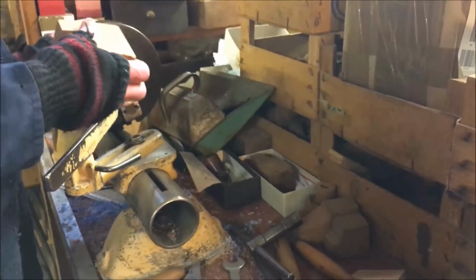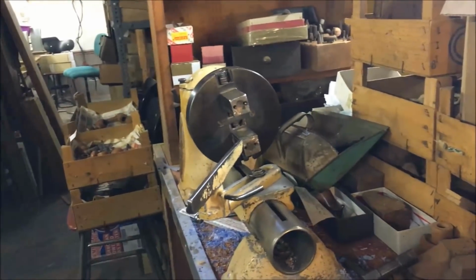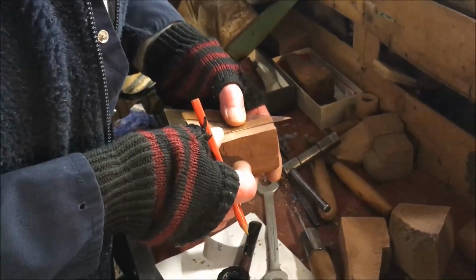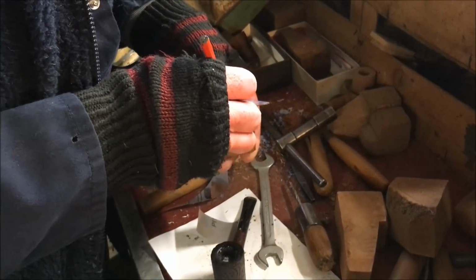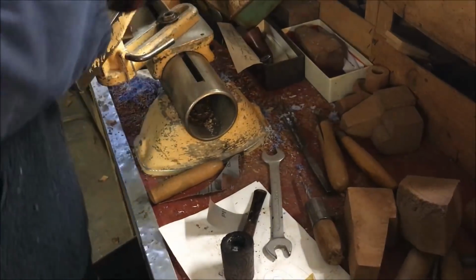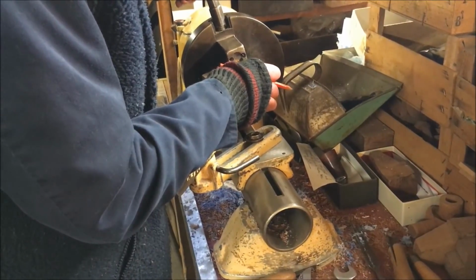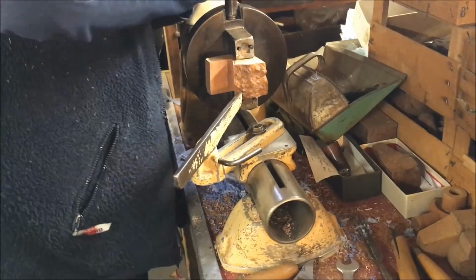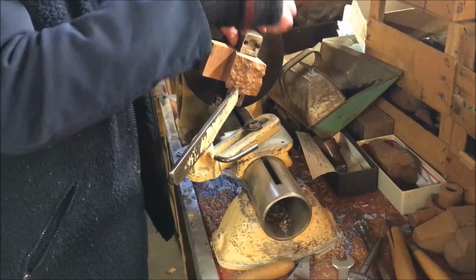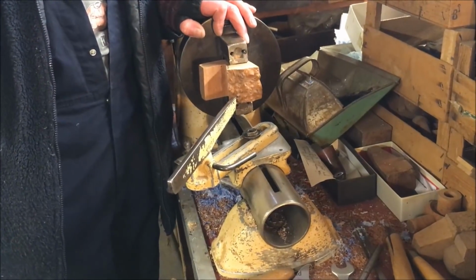No, I'm talking about the top. Oh, I see. You mean with a lathe. Yeah, if I can make a few lines on this. It's another thing that I usually do, is to mark where the draft hole is going to go, so that when I'm boring out the chamber, I've got a line there so that I can measure from there down to there, to make sure I get it to the right point. Right. Not go too deep, not go too shallow. It doesn't matter to within a few millimetres, because you can adjust that when you actually drill the hole.